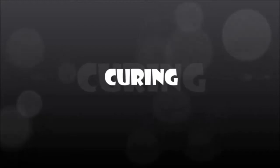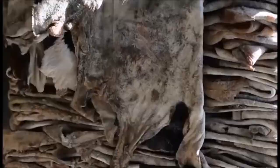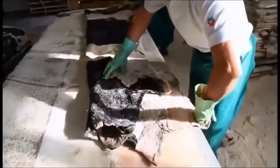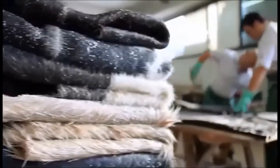The first stage of leather tanning is the curing process. Curing is the process of preserving the hides from getting spoiled well before exercise of various processing and to use them purposely later on. It is done at controlled temperature, pH, moisture and by using toxic chemicals.